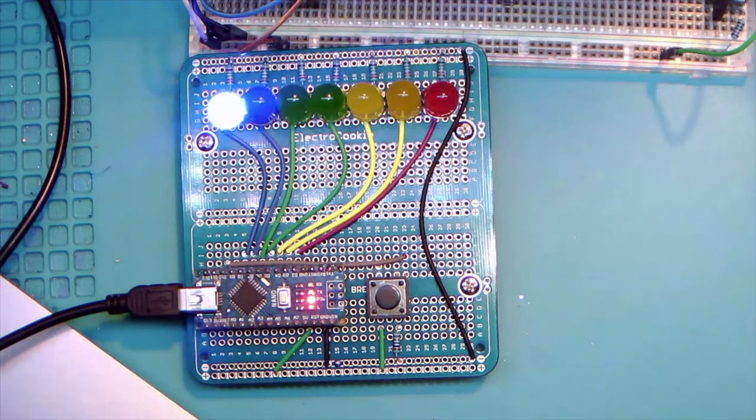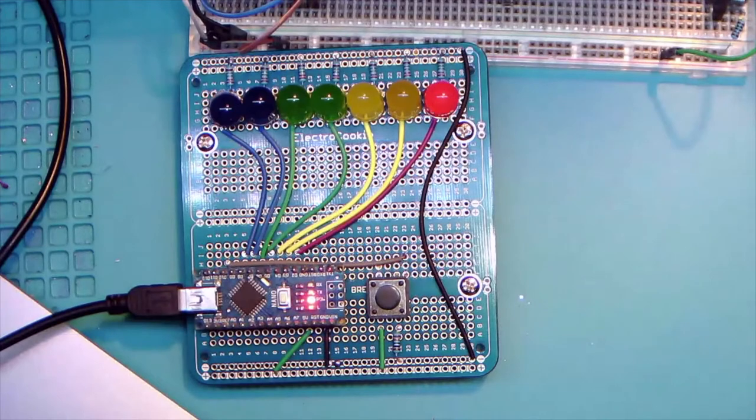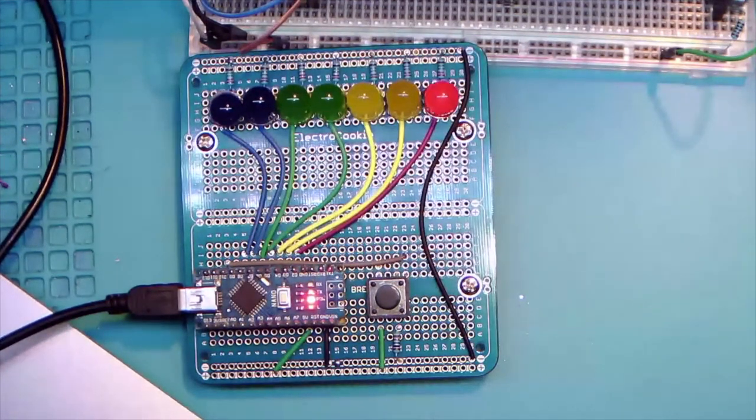And that's not even the right code. Wow. Let's try this one. That's some other test code that I will actually post, courtesy of Blendster, who's used it for other programs that he's run. And let's try this one. I really miss Vegas. And there we can see what your test blink sketch should look like on your breadboards. And we'll flip this over to the blue one. Every time you change the defined number to a different number, it's going to blink a different LED. Now my blue is blinking.